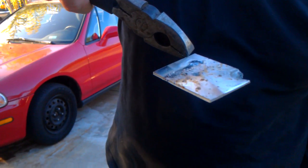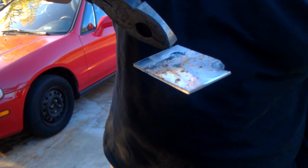As you can see, it's popping off a little slag and other contaminants off the aluminum. If you want to weld aluminum, don't use a flux core welder. Use some aluminum MIG wire with argon shielding gas, or use a TIG welder — a gas tungsten arc welder — with argon shielding gas, because it's not going to fuse. It's not going to do anything but crack on you and make your aluminum look really ugly.